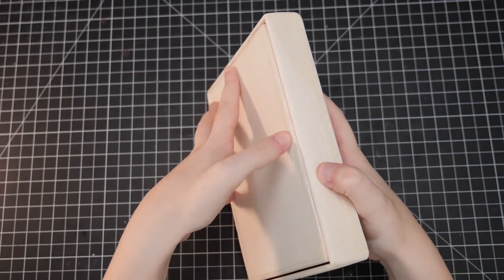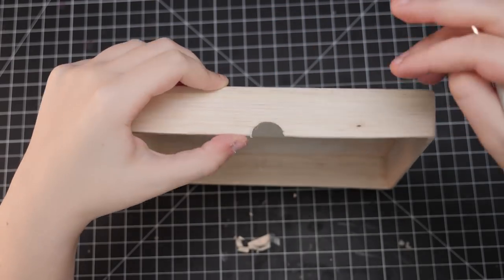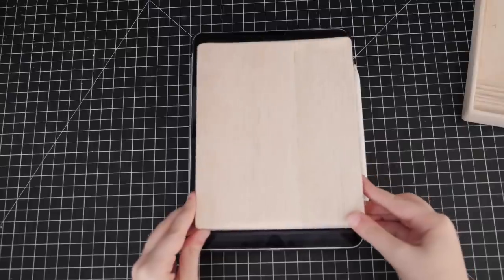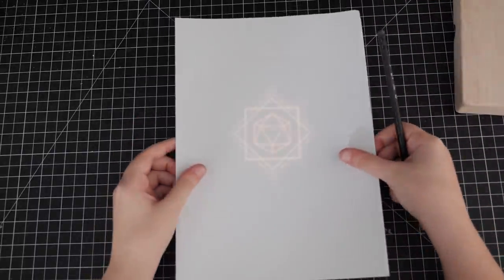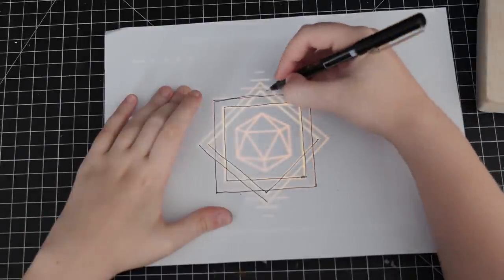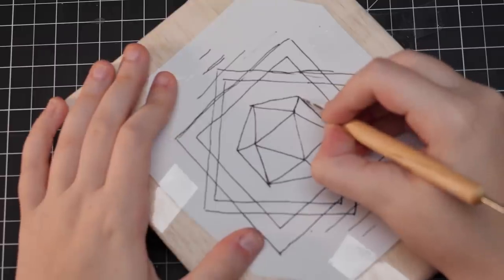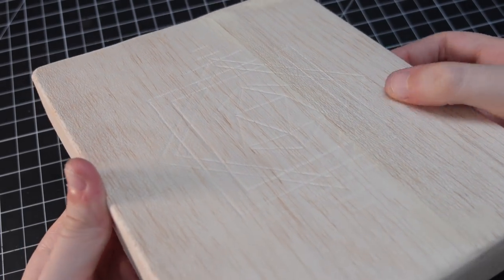After some test fitting I realized it was a bit hard to get the box out of the tray, so I marked a half circle on the longer sides of the tray and cut them out, giving me a slot to grab the inner box through. It's a bit boring as is, so to give it more flair I searched for cool designs to transfer to the top piece. Because I don't own a printer I resorted to tracing over the design by putting the paper on a bright screen — just don't use a touch screen. Once the design was ready, I taped it to the top and went over it with a sculpting tool. Balsa wood is so soft that this easily traces the design by leaving a groove behind, and that groove was pretty helpful for the wood burning step coming next.